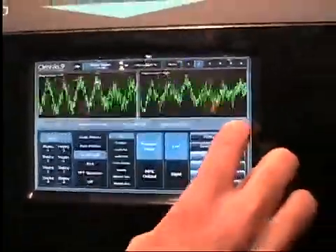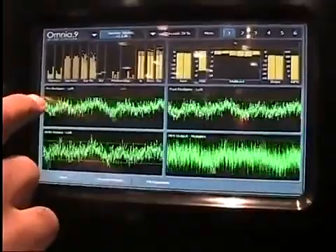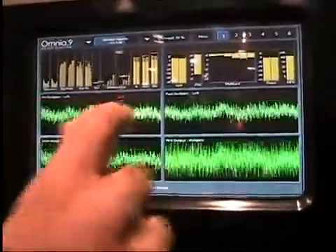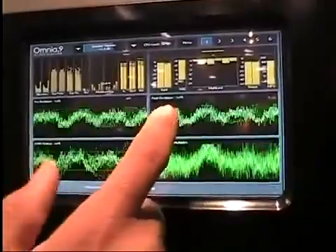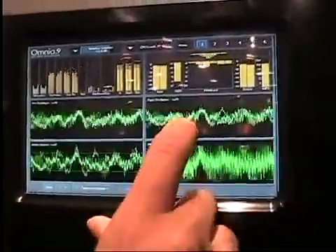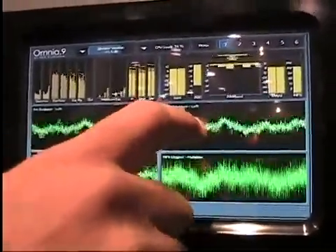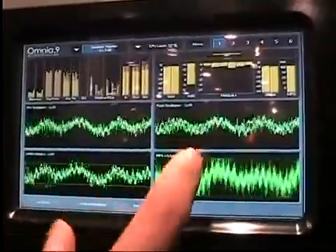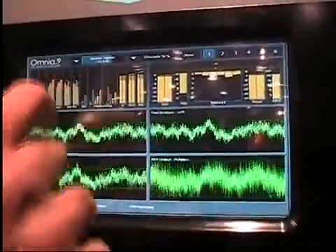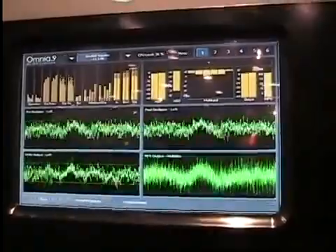So to show how that works, let's look at these meters. Here we see the left channel as it comes in before the declipper, and the green line is the detected declipping threshold. This oscilloscope shows post — that's after the declipper. Notice how it actually restores the peaks. It's not just a simple line interpolation, just drawing a smooth line from one end to the next, but in fact it rebuilds all the detail based on what's in between the clipping areas. This really removes the audible distortion, removes the crackling, and makes it sound almost like it was properly mastered.